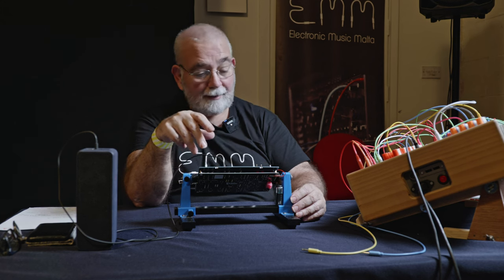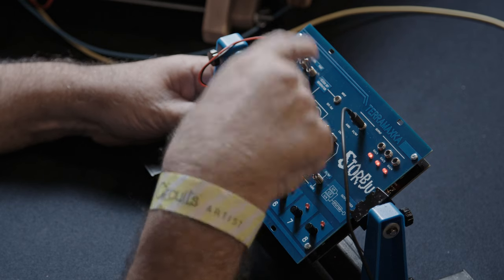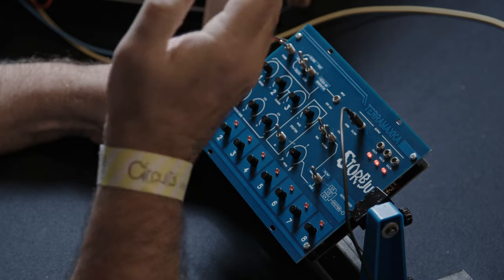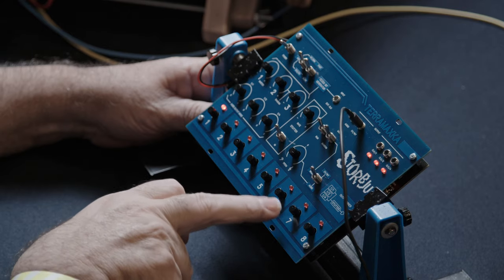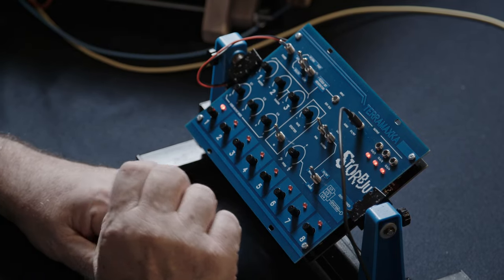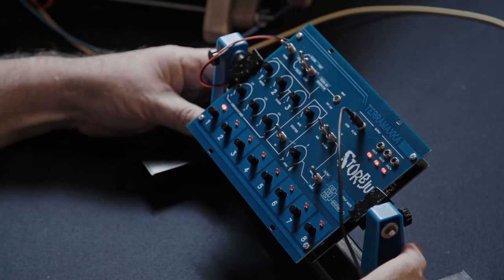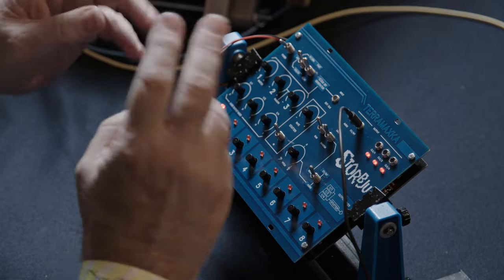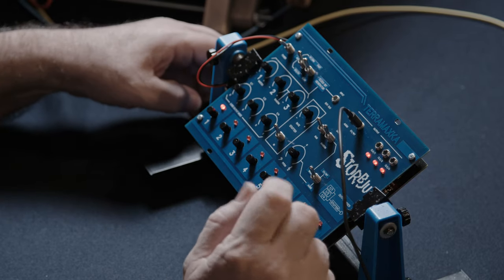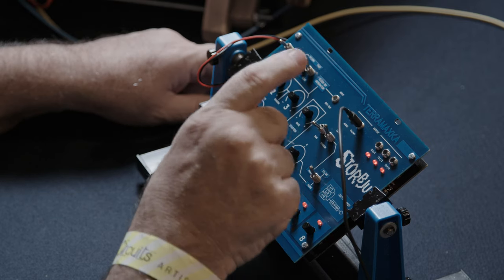Right, CV mode. Okay, I will now run it in random mode. Before, we had an ordered reading from memory location from channel 1 to channel 2, 3, 4, 5, 6, 7, and 8. Now it will access these in a random fashion, so the settings would no longer be applicable. Instead of just a simple square wave, we can have a lot of voltages coming in and out, which would be translated into a much more complex and hopefully more interesting sonic wave. Now we slid over to random.